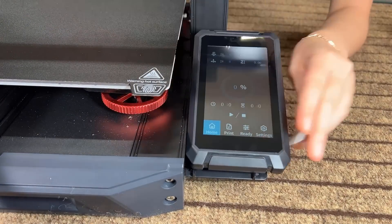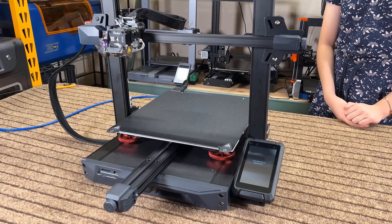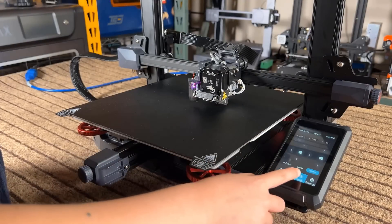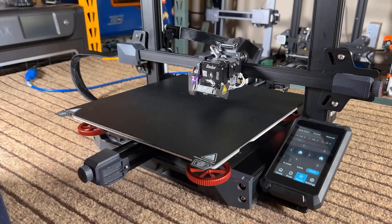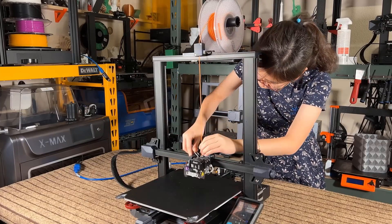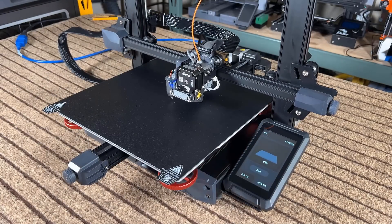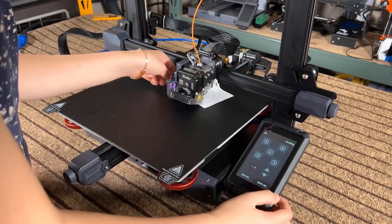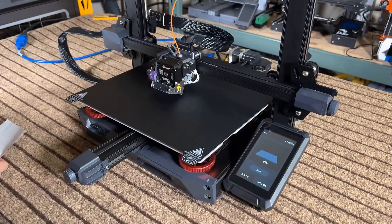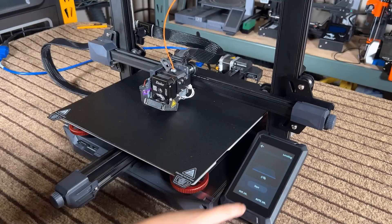Remove the sticker and plastic protective surface from the screen. We will now preheat the printer so we can feed in filament, but be sure to move the extruder higher up so the nozzle does not burn the print bed. Click preheat PLA and then feed in filament until you can see some coming out of the nozzle. Insert the SD card. Before we can print, we still need to level the bed — let the printer home first, then adjust the Z offset using the paper test and the up and down arrows on the screen. Now we can start manually leveling each of the corners. After adjusting the four corners, the height of the bed will be different, so we have to check the Z offset again. Finally, let it do auto bed leveling.